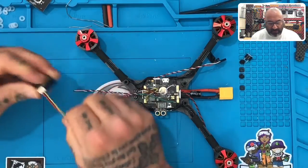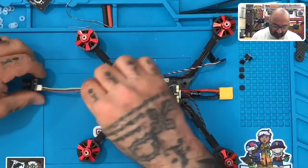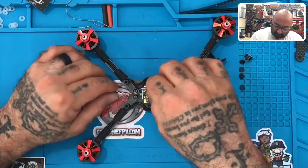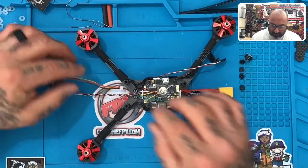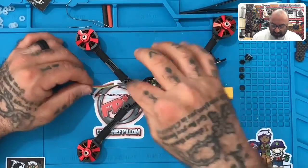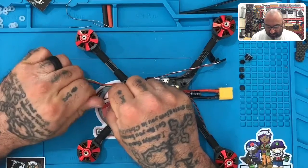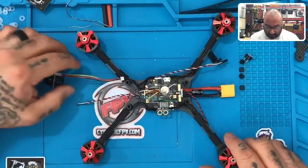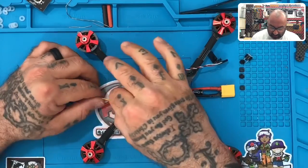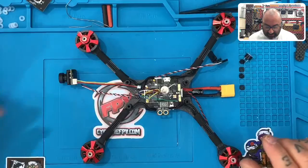Your pattern will be red, black, yellow. Now, normally I could say you could just pull this out and plug this in, but if you put it in incorrectly there could be a serious problem and the camera could get damaged. So we're going to do this the normal way, which is to cut the wire and then solder them together and then cover them with heat shrink.